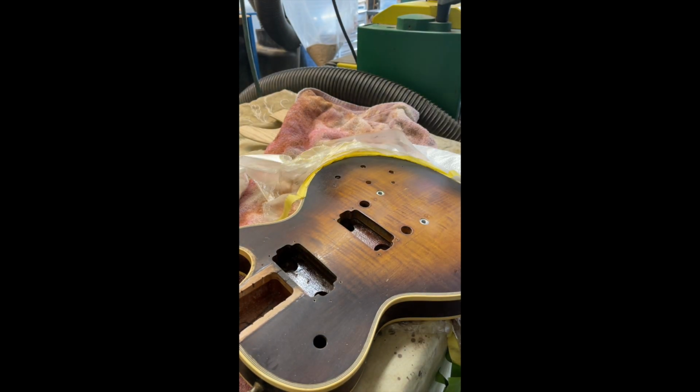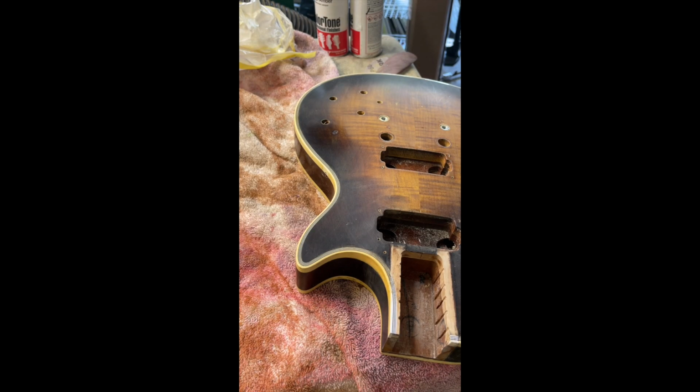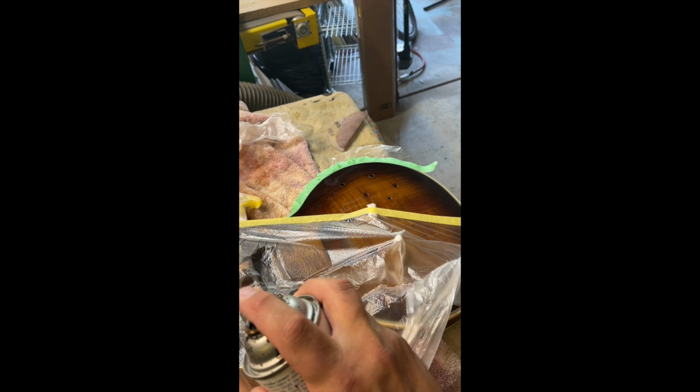That was vintage amber we drop on there, just to color it slightly. Sand it off. Here now it's hidden pretty well. And then we have some clear lacquer we use to start sealing it up. We do about 6 coats because we're going to have to sort of re-level it down anyway. I had to cover up those post holes, getting lacquer in there. And then we're going to add a little bit of brown. I didn't like the exact color that it was looking like, so we add a little bit of brown just to get it to look like it was resprayed.